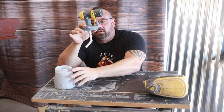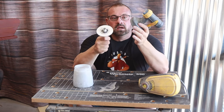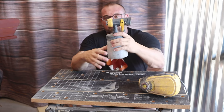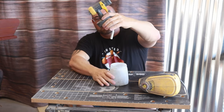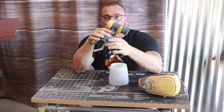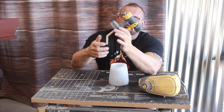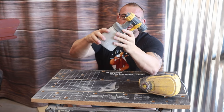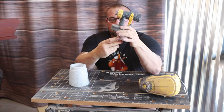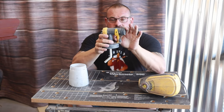This right here is the pickup — it's how you pick up the paint. Most of the time you're just going to have this facing forward the same way you're spraying because you want it to pick up the very last of the paint in the container at this angle. If you're going to be spraying a ceiling or the top of walls, you probably want to turn it that way so it's picking up the last of the paint out of the container. But most of the time when we're doing furniture it's going to be lower or straight on, so I just put it facing forward.